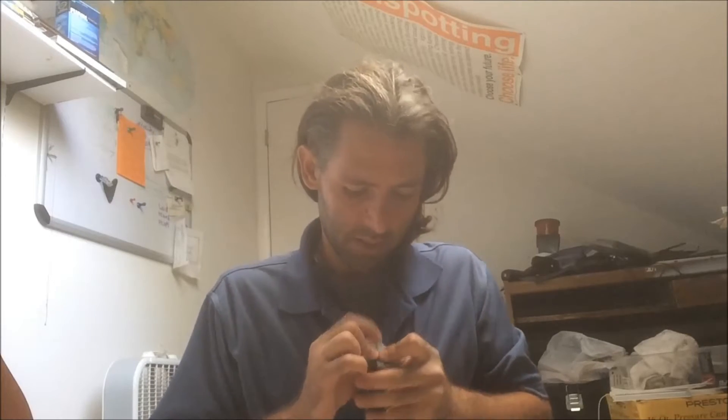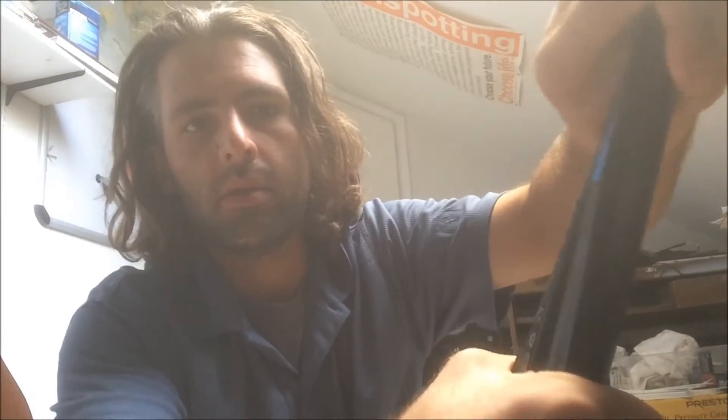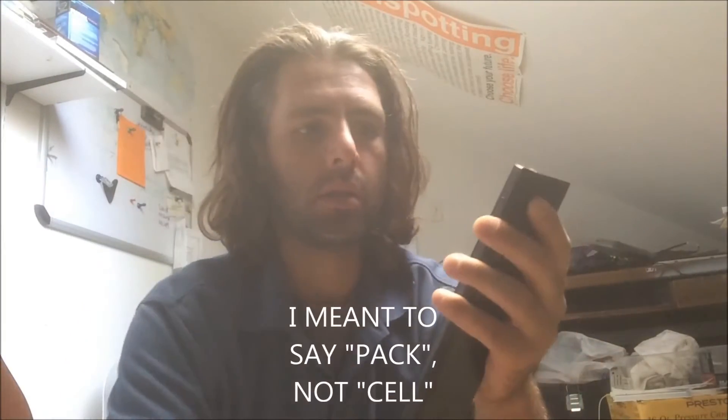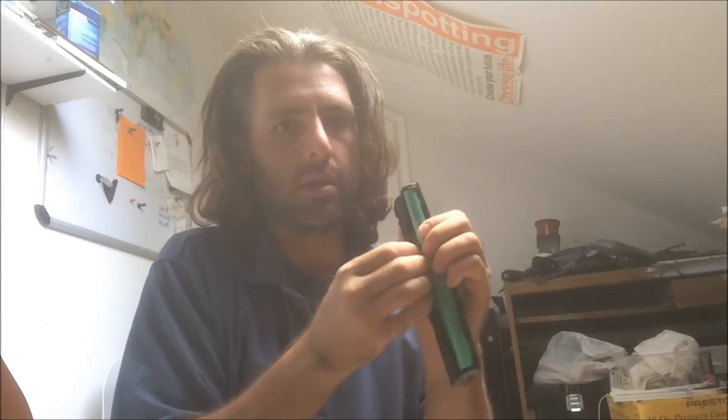Here's how I open them. Just give it a twist — twisting it breaks the ultrasonic welds in the case. And if you want it to come apart a little easier, pull off these stickers and you can see right in the cell. Just rip it open. The plastic has sharp edges and you can cut yourself.